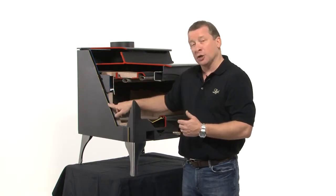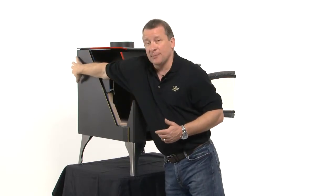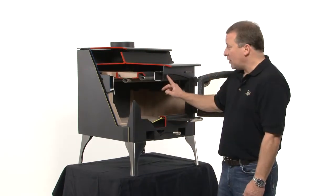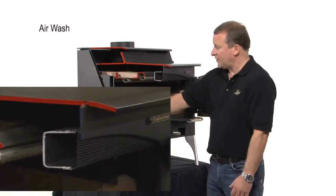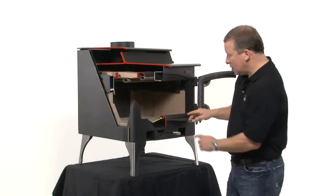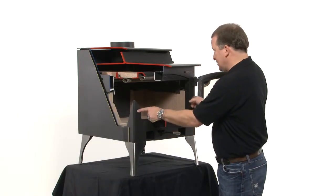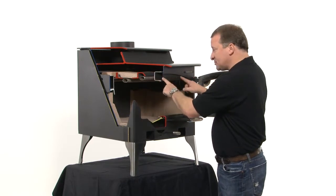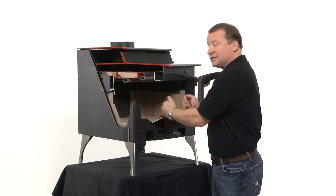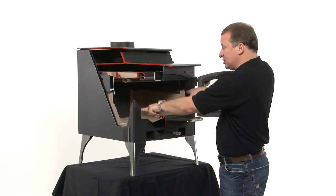This shielding allows you to get closer clearances, and that heat is still allowed to escape up here at the top. The standard shield in the back of the stove is what gets us four and a quarter inches away from the wall. The air wash here is cut away — what we've got is one tube that comes up on the left side and a tube on the right side. The air that comes in through the air control goes to the left and the right, gets pulled up, and comes into this perforated screened area up here. The screened area is what diffuses that air evenly across the entire surface of glass, and all that air is being preheated as it's drawn up these two side tubes.